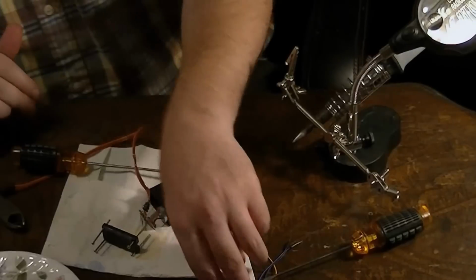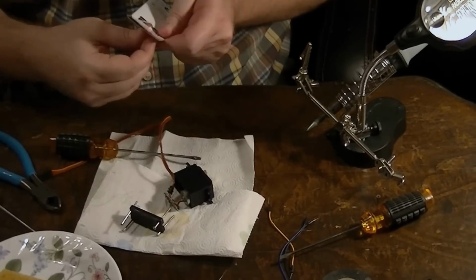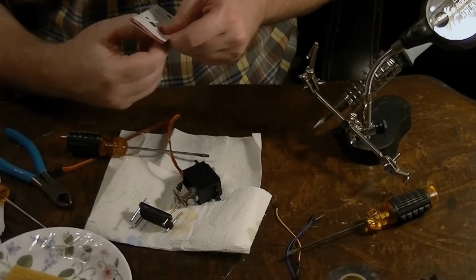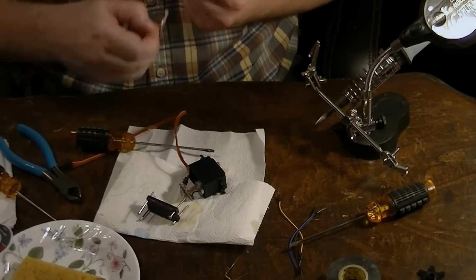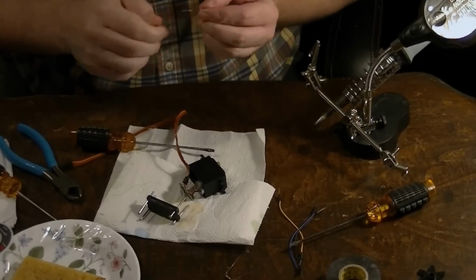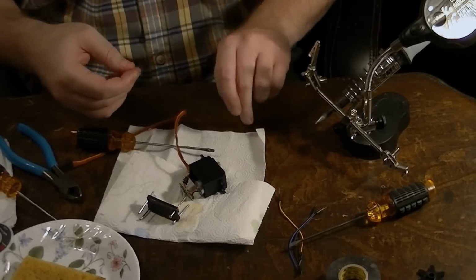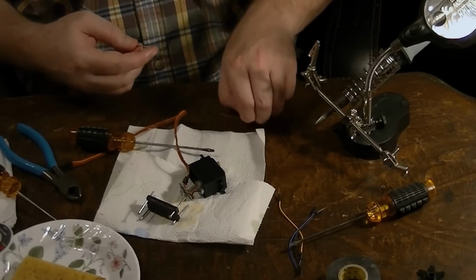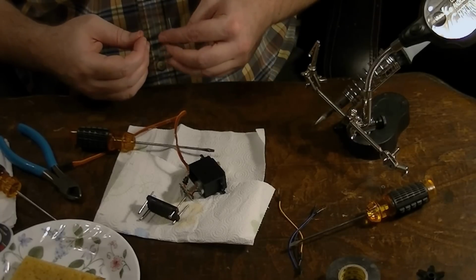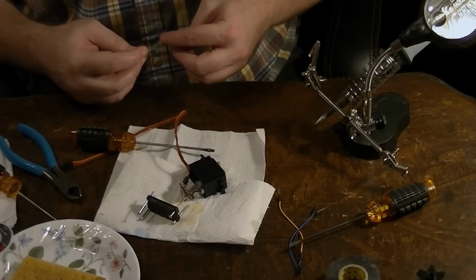That's all I did. Now we're going to take our 2.2 k ohm resistors. The idea behind the 2.2 k ohm resistors is we have to fool the little logic board into thinking we still have the potentiometer in there. 2.2K happens to be approximately half of a 5K potentiometer, which is what we just disconnected. So I guess really 2.2, no, that's wrong. That's inaccurate. Cut.